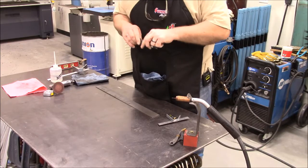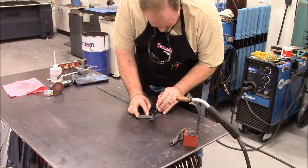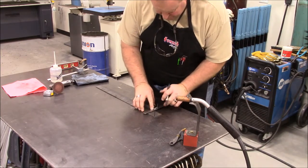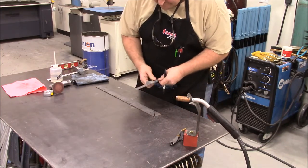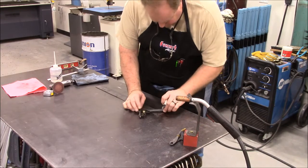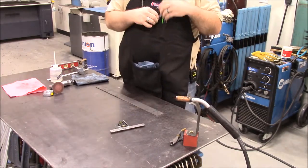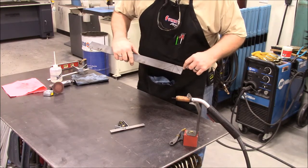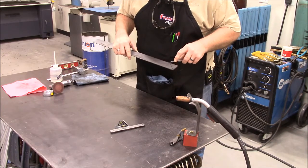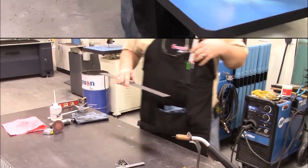So we're going to make this as easy and quick as possible. We're going to do a triangle and square that off, another triangle — that should give me three tabs in which to radius the top. I'll just take and radius the top and make this — it's actually probably about an inch and a half. Just shy of inch and a half, so I'll be in about an inch and a quarter by the time we round it on the band saw.